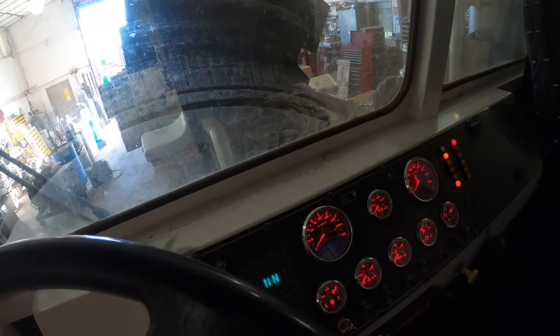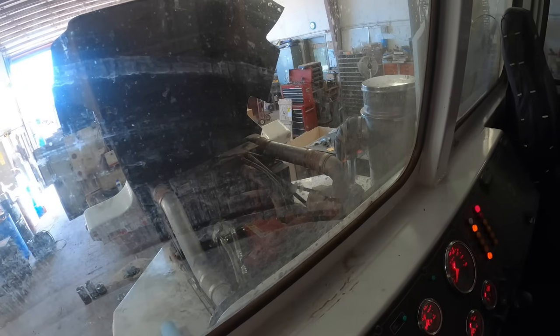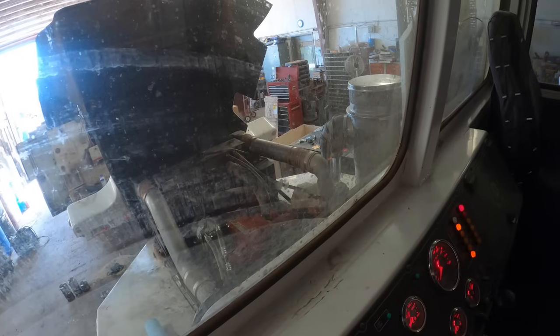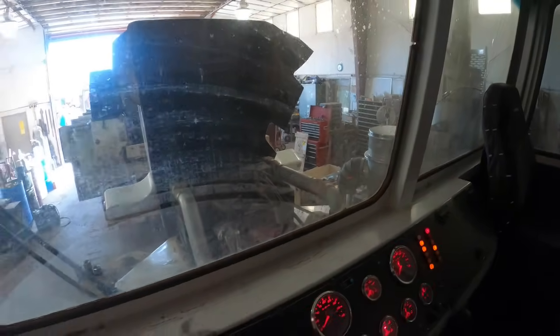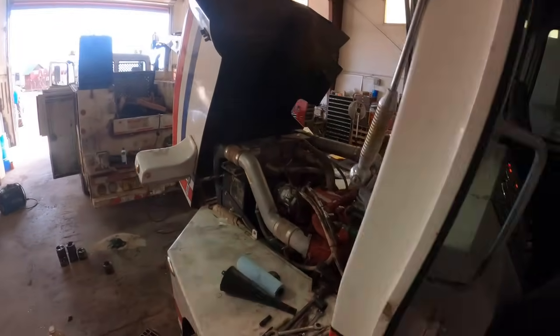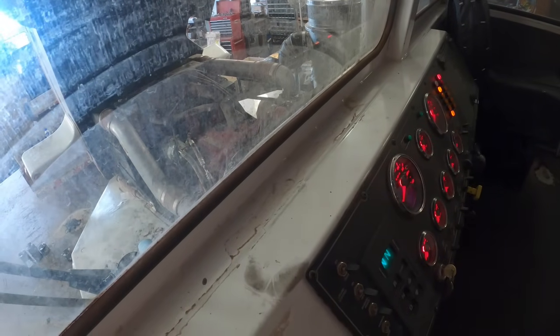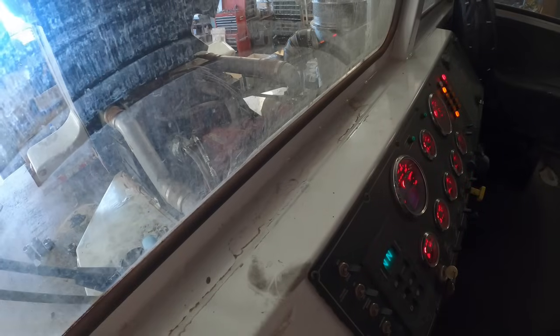There's a little pressure gauge on this thing yet. Right there. Sounds good when it's cranking. Let me bleed it out at this filter head right here. There's a bleeder right there on the filter head, a 5 millimeter Allen. So I let the cycle run fuel out of there for a while. Now let's shut it off. I'm gonna cycle again. It had plenty of fuel. I was putting the plug back in it while the pump was running, and it was trying to push the plug off. It's building pressure.